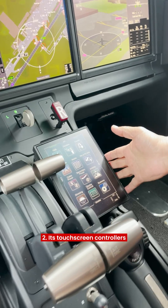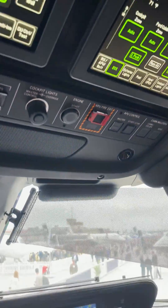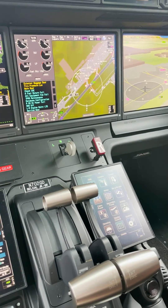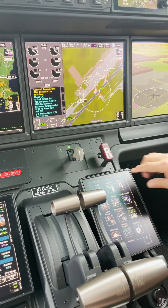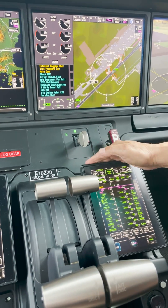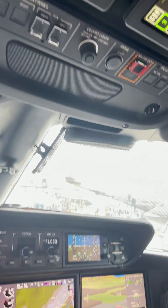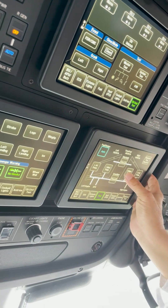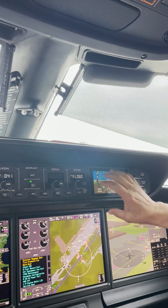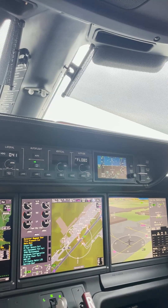The second part is the touchscreen controllers. There are three different types, called TSCs, including overhead touchscreens and standby touchscreens. Instead of working like your phone — which uses a spark in the human to detect touch — these require a little bit of pressure, only about 3 ounces or 80 grams. Additionally, because we live in a turbulent world, there are edges around the screens that you can hold on to, so as the airplane goes up and down in turbulence, your hand moves at the same rate and you still have control. On the standby screens there isn't enough room for that, but even so, everything can also be done with a manual push button to control the airplane.